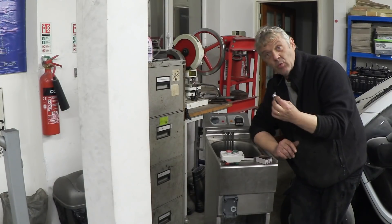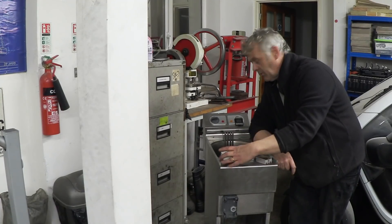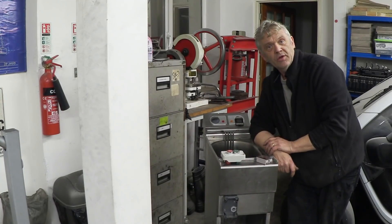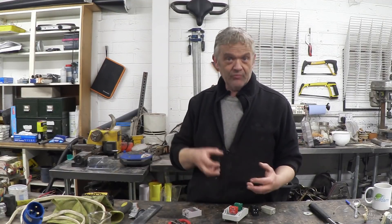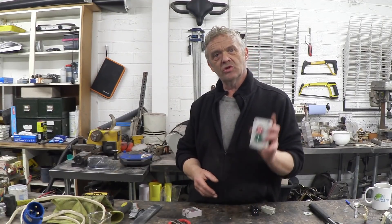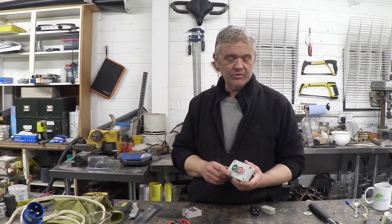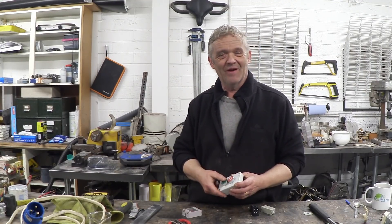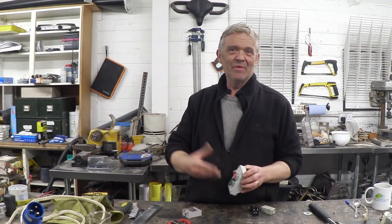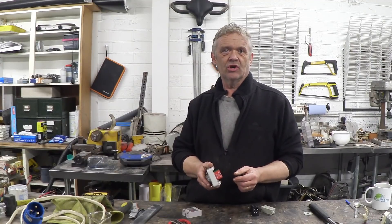That safety switch gets wired in the live connected to the bowl. We wire up the switches and wire everything up in accordance with the diagram. Because we want a stop-start button and we've moved that to the front, what we're going to use is these momentary switches - universally used for stopping and starting machinery. You press them and they don't latch. You can't really fry food with your thumb on a button all the time, so what we use is something called a relay latching circuit.